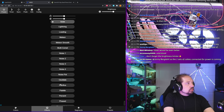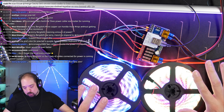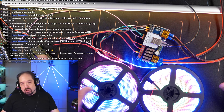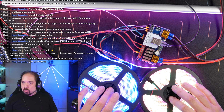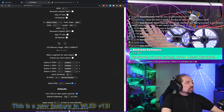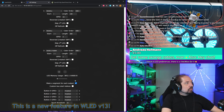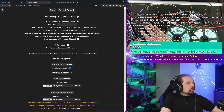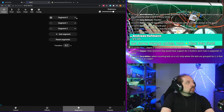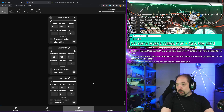Let's see if we can do an effect. I like the Palette effect, for instance — that's working great. But now all of these are acting like one big LED string, and in this scenario you probably wouldn't want that because these are really three separate LED strips. So let's use 'make a segment for each output,' save, and reboot. After rebooting, we do indeed have three segments corresponding to our three outputs.